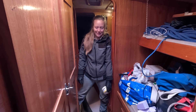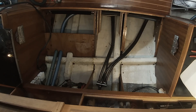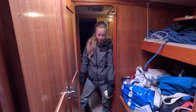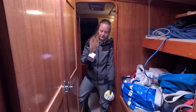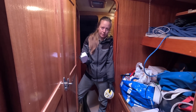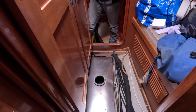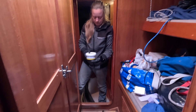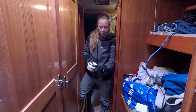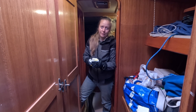It's a rainy day today, so we continue with some inside jobs. After cleaning, we've put the two tanks back in place and we're going to start with the new sanitary hoses for the bow part of the boat. We use XPS foam as a standoff to get a better shape against the hole — it's quite cheap and easy to form. We opened the inspection hole for one of the tanks, so we're going to reseal it using some sanitary putty. Then we'll continue with the new hoses from the tanks to the toilets and to the pump station, and also the aft part which still has old hoses.